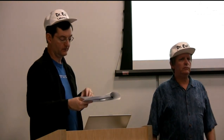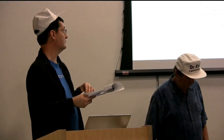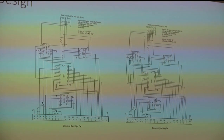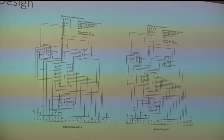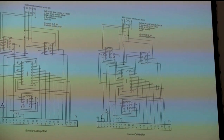During prototyping we realized the Commodore, with the right software, could handle double the standard maximum - 38,400 baud. To make sure that worked, we used the 2MHz A version of the 6551 so it could keep up with these faster baud rates. We used the MAX234 rather than the MAX232 because it had the right signal line configuration - four outgoing lines. The MC1489 handled the incoming direction much more cheaply.